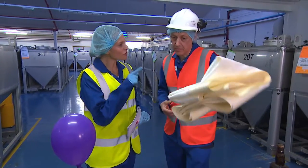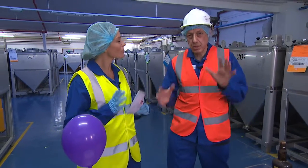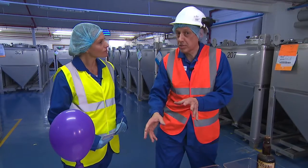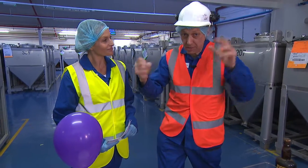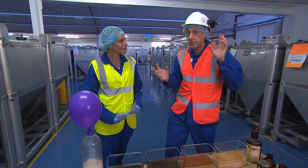And once that comes through, is that Marmite going through? Once it comes through there, there it is. But just so you understand, because it's gone through there like that, there's still a bit of water left, so we put it into another evaporator, and all the solid material that's in there gets more and more concentrated. So the volume goes down, the storage goes up, and eventually...